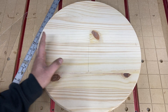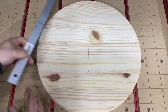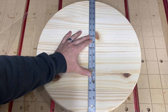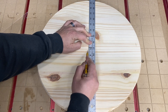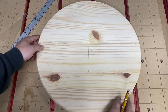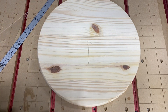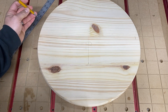Hold your straight edge right there. I have one of these drafting squares — really cheap and easy, I'll leave a link in the description. Register that against your straight edge, come up to your line, and draw a perpendicular line. Now we've found center left to right. Take your straight edge, line it up with that line so you know you're dead center, lined up on top and bottom. I've got 17 and a half inches — half is 8 and 3/4 — put a tick mark there and that is your exact dead center. Bring your router to that point, set XY zero there, Z off the top of your material, and you're good to go.